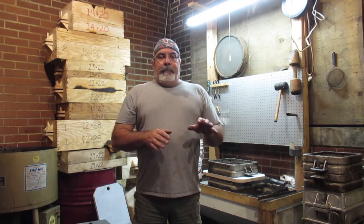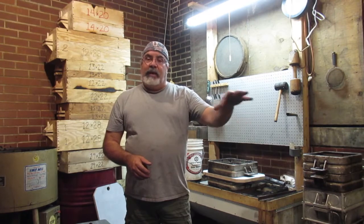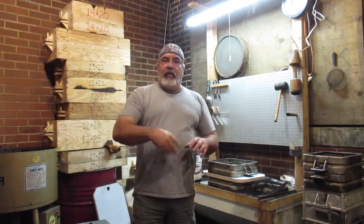The other thing with this is he couldn't find the brass with a little higher lead content, and he didn't have it. So I asked, well, can you give me what you've got, and if I add some lead into it? And he said, yeah, we could do that. So I've got 50 pounds, and I have to put 8 ounces of lead in there too. I got little chunks of 8 ounces of lead that will go in at the very end. If I put it in now, it'll just burn off, and we don't want that to happen. So that'll go in at the very end.